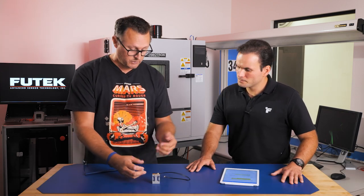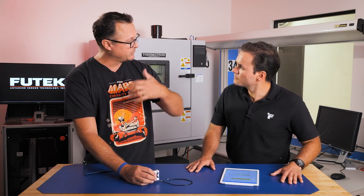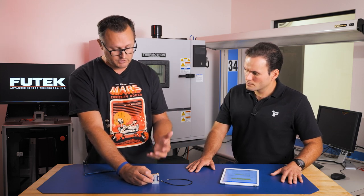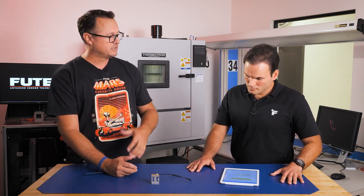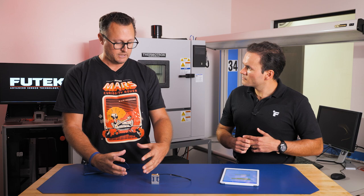We also added another feature on the front end, which is 4 solder connections on the front. So if that connector, for whatever reason, doesn't work for the application, it allows whoever is using it to solder those 4 connections, which just gives you the bridge only for the measurement. It doesn't give you the PT1000 or the TEDS capability. Excellent, just adding that in case someone cannot use the connectorized version. Yeah, but our goal is to allow that connector to simplify the manufacturing process. So we don't only look at our total cost, we look at the total supply chain cost, which includes the customer integrating it, implementing it, the resources and time for them to make that connection to their system.